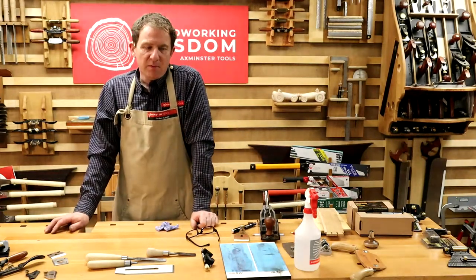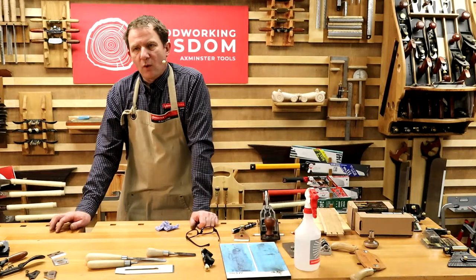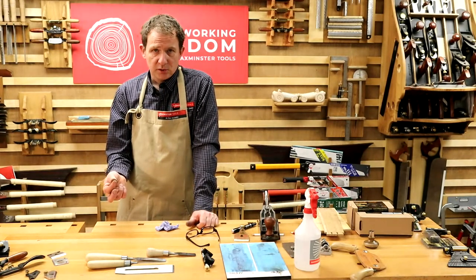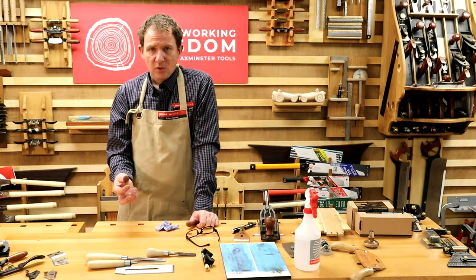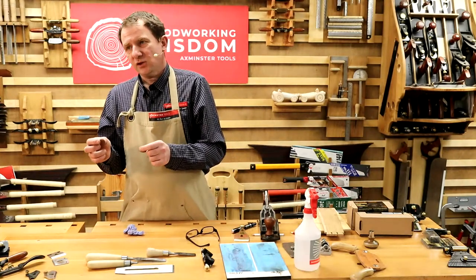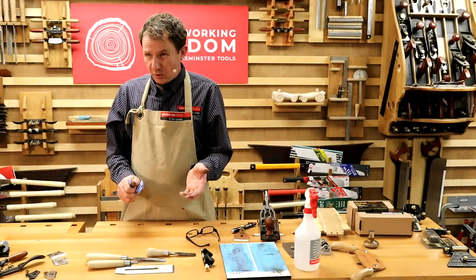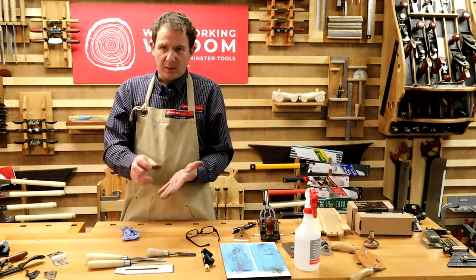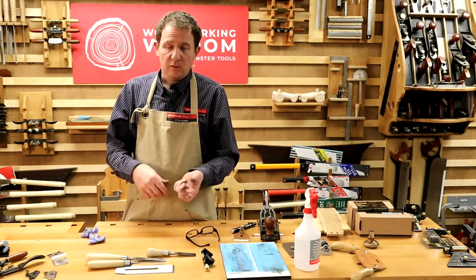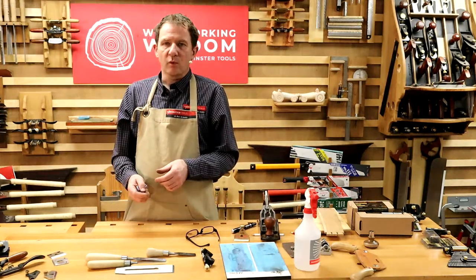Let's have a think. At home, if I was doing it, I'd probably go with a melamine lacquer. So you could spray it. The other good way, which if you've watched us regularly, we use the buffing wheels, the polishing mops. That's really good. So I go with cellulose sealer, and then I go to the mops. Go careful how you hold your tube. You can hold it on the mandrel, but don't touch the steel parts on the mops, or it will turn the mops black. On an African blackwood, that's not going to be too much of a problem. But when you start putting lighter woods on, the black will come out of the mop and stain it. So try and keep that away, but you can hold it on the mandrel to buff it. A piece of dowel can be good as well, but you've got to stop it spinning, it's got to fit tight. But I would probably buff them or spray them with a melamine lacquer.